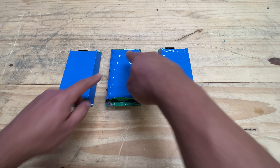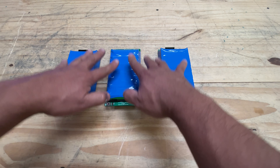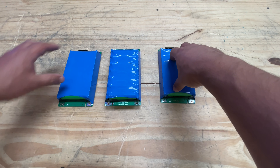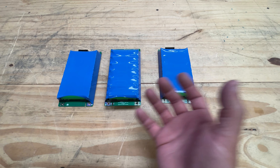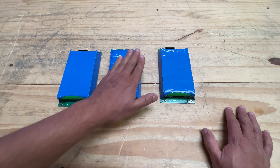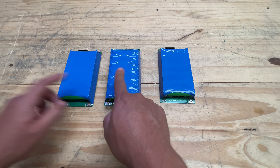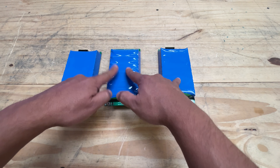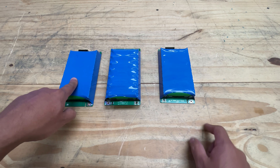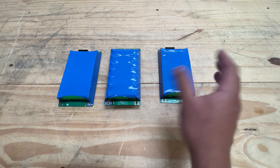There's power in the secondary battery but you can't easily use it. Also, when charging, do you want all batteries to charge simultaneously or prioritize the main one first? And there are BMS safety issues: if the BMS in an external battery shuts it off at zero charge, then when you start charging, the charger may only charge the main unit and not the external ones. These are all the problems with dumb batteries.